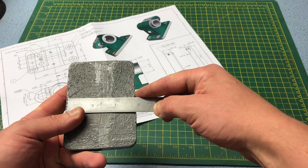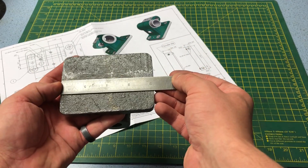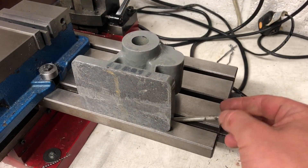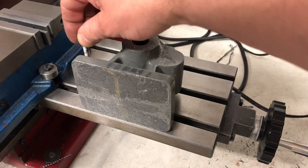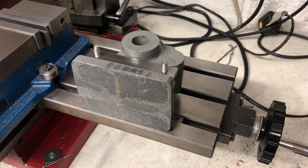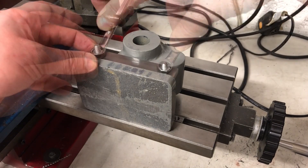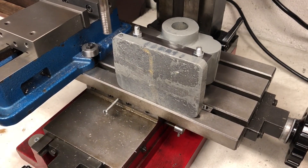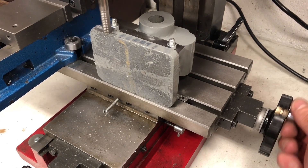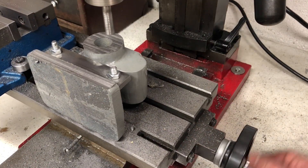The dimensions are all on the plans, and the spindle housing length is to be the same as the base, so both surfaces can be machined together. The first operation is to flatten one side, which will then become the reference face for all other operations. With the casting sitting on its side, the cast spindle housing sits reasonably square in both axes straight out of the mould. So I am simply going to bolt this to the mill table as it is and flatten off one side. I have chosen this orientation deliberately, as the spindle boss is to be machined to take a mounting bracket, and by taking just enough off this side to clean up the surface and then removing material from the other side to bring it into dimension, that guarantees having enough material to accommodate that bracket. I am taking about 20 thou in two stages off this side, with the final pass having quite a small step over.